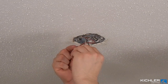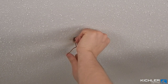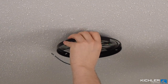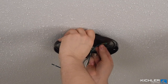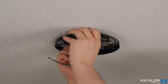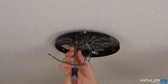If you have an extra wire for separate light control, cap it with a wire nut and tuck it up into the box — it will not be used for this installation. Locate the ceiling bracket assembly. Feed the wiring through the center of the bracket and attach the bracket to your junction box with appropriate screws. Ceiling fans should only be mounted to electrical boxes visibly marked as suitable for ceiling fan support. If you have any doubts about your electrical infrastructure, contact a qualified electrician.